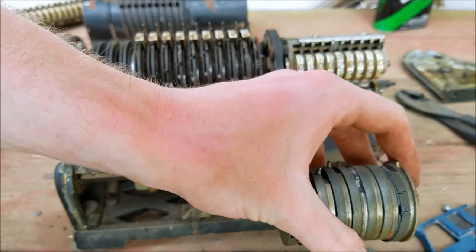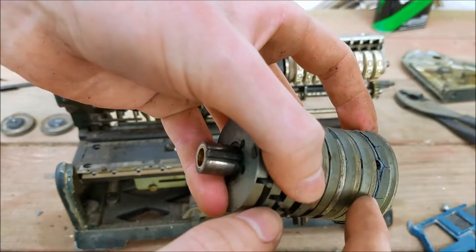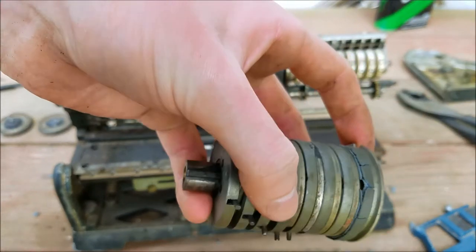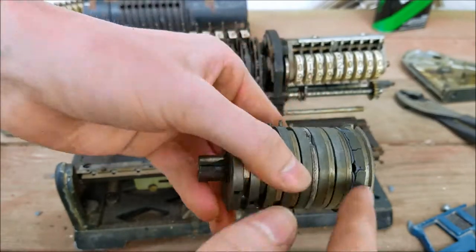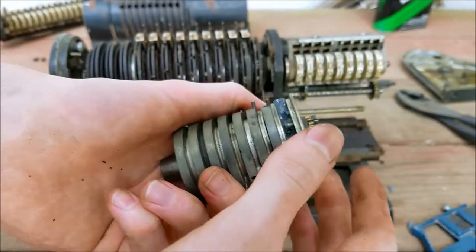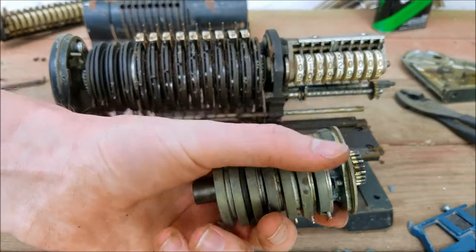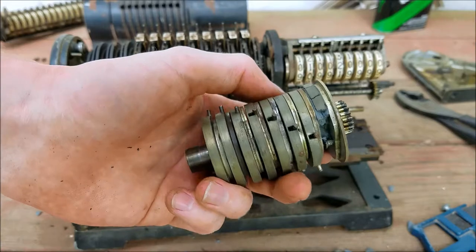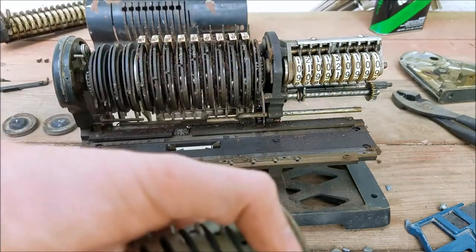It slides back and forth with that finger to whatever position you're in, and then it counts at that position. This just does the tens carry. So you can see I kind of broke a piece of it out here to get that loose. But look at how it just expanded — look how flush that one is and look at this one, just all expanded and puffed up all over the place. So what I'm going to do is break up the rest of this and hope that the shaft still stays together, so this will be out of the way and it should turn freely. The only thing that will affect is you won't get tens carry from this last position — everything else will work just fine.